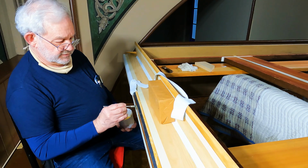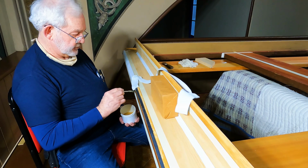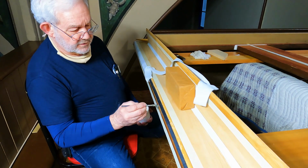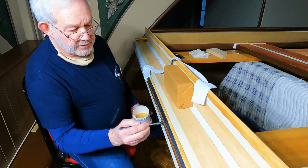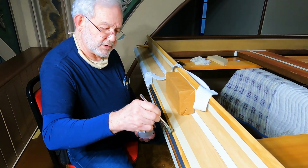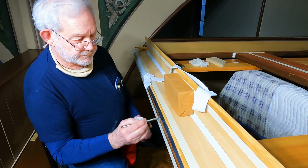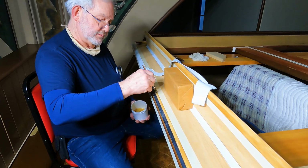I've had reservoirs in years past that had a problem with the glue bubbling after I glued something down. And that was before the days when I used to make a habit of always sizing. And then I had to essentially work out a way to clamp it, keep it clamped while the glue set so that that wouldn't happen. It was just the air coming out of the wood. So I modified how I did it based on suggestions from other people in the trade. And I applied their suggestions to what I was doing, it made the job better.